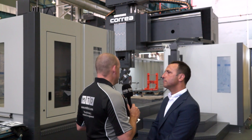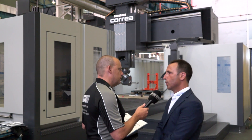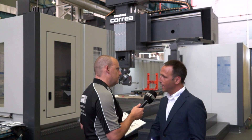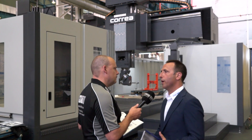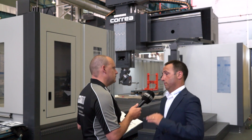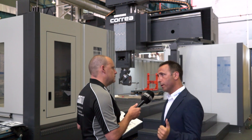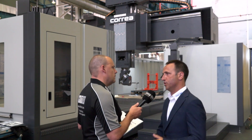I did also read that you do a 24,000 rpm head on this machine. Yes, we use an electro spindle. For heavy cutting we have a mechanical head — 6,000 rpm, 52 kilowatts. But for finishing we have an electro spindle. We have three ranges: 12,000 rpm, 20,000 rpm, and 24,000 rpm for pure finishing.